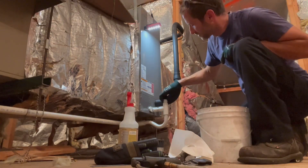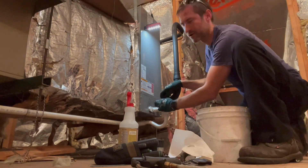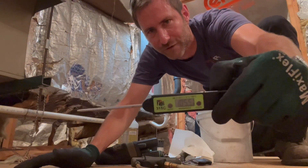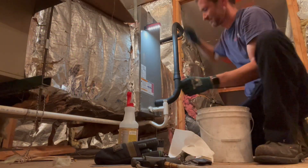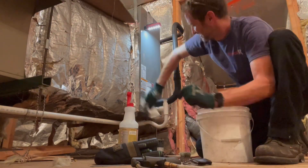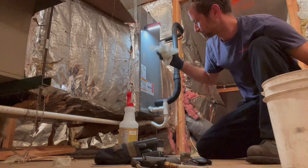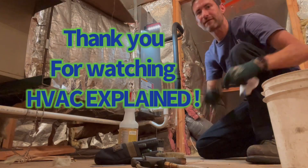One other thing I'd like to mention — technicians work in every condition. I know I'm starting to glow here with sweat. 105 degrees Fahrenheit, and there's no airflow right now so it gets a little warm. You've got to do what you've got to do — we signed up for this deal, so have fun with it. And that's pretty much it. That's part of maintenance: changing filters, flushing drains, checking belts, cleaning coils. Thank you very much for watching. Have a good day.